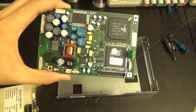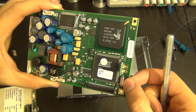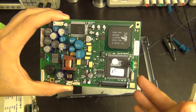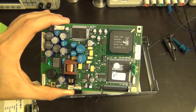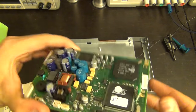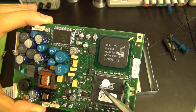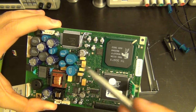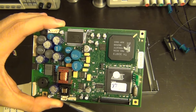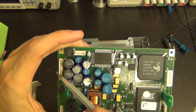Here's the infrared port. There's one crystal here at 3.6 MHz. Remember there has to be some clock alive on this for the soft power switch to work - it has a dedicated microcontroller monitoring power in the background, handling battery charging and the power switch. There's another crystal up here, which I think is 30 MHz, clearly connected to this component. There's a bunch more memory and DC-DC converters. Here's where the DC power comes into the unit, and here's where the keyboard connects.